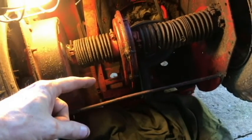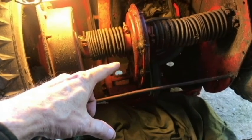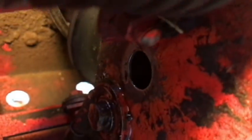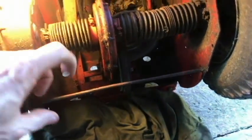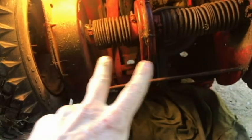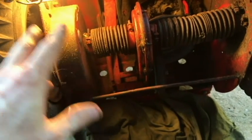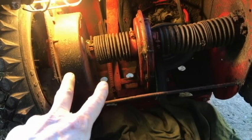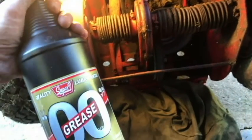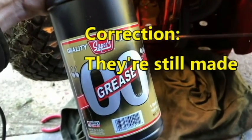When I checked the grease, it was dried and I couldn't feel anything in there. I took out the little cap in the gear case and probed around and really couldn't feel anything. I didn't have the grease Snapper recommends, so I used this 80-90 gear oil. It's a lot thinner — it will make your seals leak, and I just don't think it's probably the right thing for these mowers.